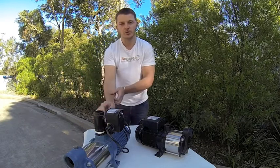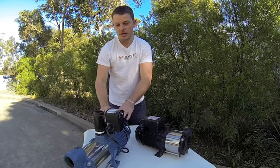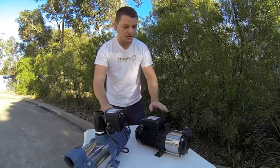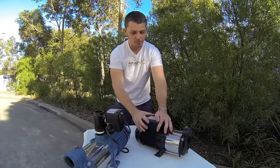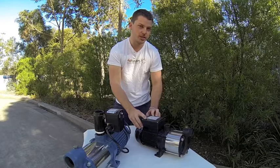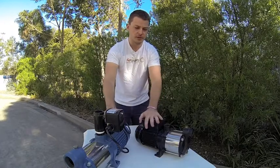This one will do up to 300 litres a minute and will go to 32 metres max head, so that's a very big strong pump. The MT43 will do a little bit larger head — it'll push up to 37 metres and do 110 litres a minute. Both really fantastic pumps.